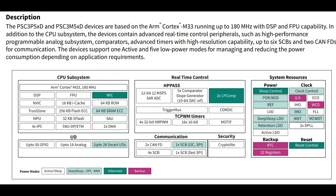It's got that basic CPU subsystem, so you're going to have stuff like I2C, UART, the FPU in the M33 — which is really handy — up to 256K of flash, up to 32K of RAM. There are a couple of variants, also versions that have CAN bus, sleep management, TrustZone, PWM, et cetera, and of course the extras.